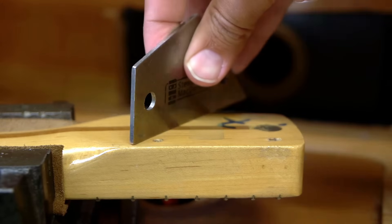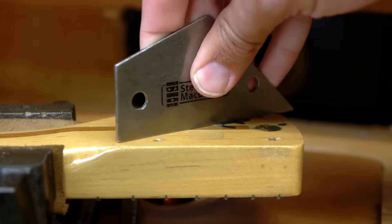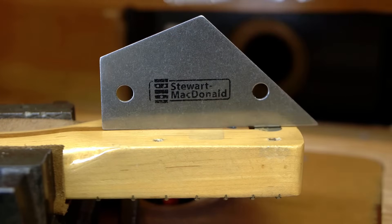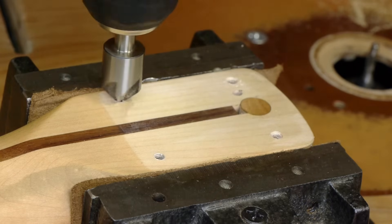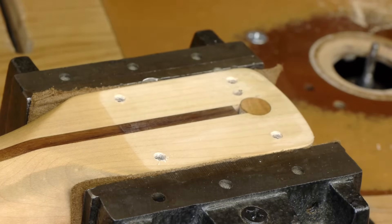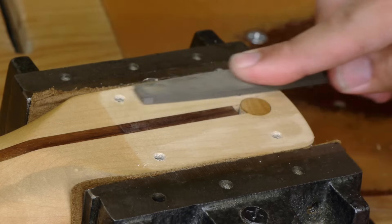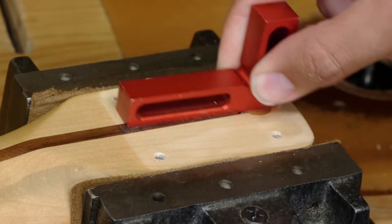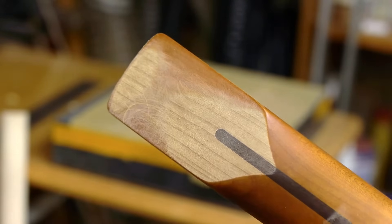Before moving forward, keep in mind that when checking the neck heel for square with the drill chuck, it's assumed the neck heel is perfectly flat — but this is not always the case. Neck screws often cause the holes in the neck heel to bulge and flare. Counter-sinking the neck heel holes before installing the screws would help prevent this, but no manufacturers I'm aware of are doing this, so it's a very common problem. To correct this bulge, counter-sink the holes to clear away some of the bulging wood, then use a hand file to file everything flat. Then glide a straight edge, like a fret rocker or a Woodpecker mini square, over the neck heel — it should glide smoothly no matter where you put it.